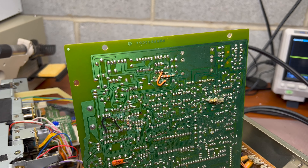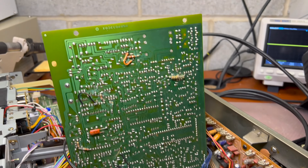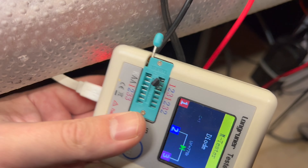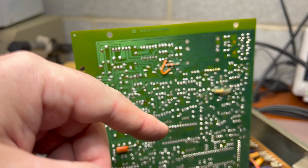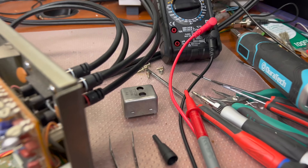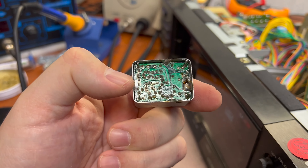This was not everything. I installed the new transistor and connected it. The control signal on the base is changing between 23 and about 4 volts — it should be working, but it did not. I removed the bias generator and it still didn't work. I tested the transistor again and got just a single diode, which makes me think something is wrong with the bias generator. Installing a new transistor and measuring it — now it turns on and off. Necessary power supply present. Now it's worked on the second transistor too, but I need to open and see what's wrong with the bias generator to fully fix this deck.